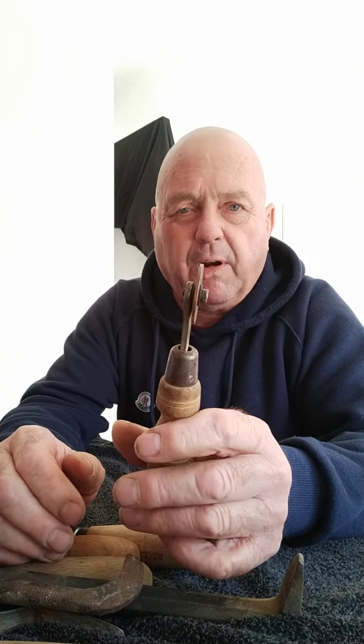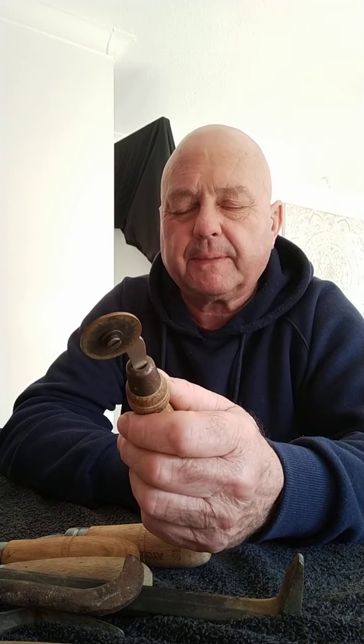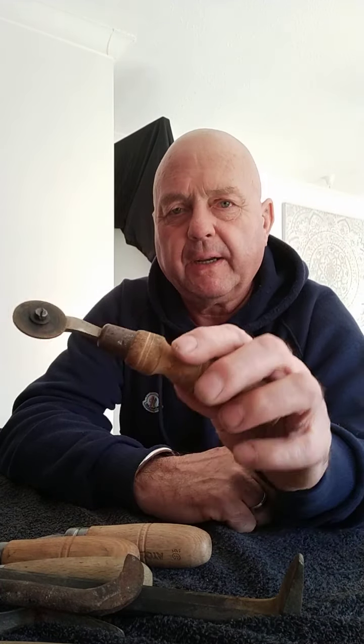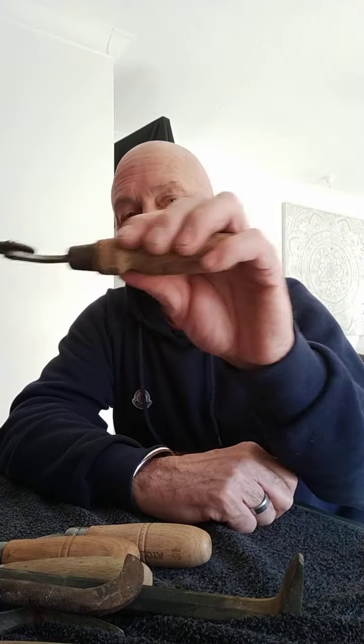And that's a penny roll. Something they've done in Victorian times. It can be a flush joint or a tooled in joint, and that's run through the middle. It's actually an old Victorian penny. That's run through the middle, and that's the finish of the joint.